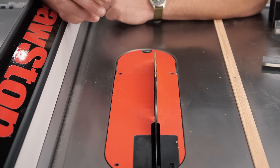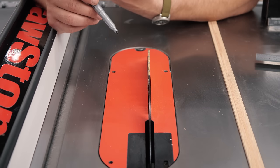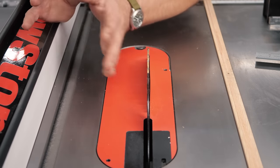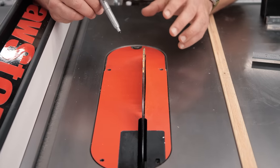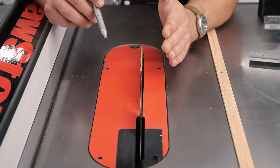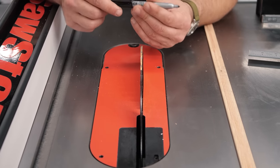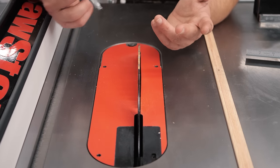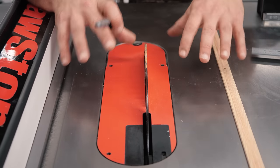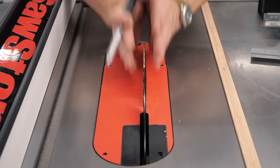The two most critical things are mostly for safety but also for high quality of cut. Sometimes you'll see burning and there's no reason you should be — that can be because your blade is turned inward, causing a pinching motion as you do rip cuts. So what's really important first is that we make sure the blade is aligned to our miter slot. Every saw is going to be different in how this is done — cabinet saws versus contractor saws are different — but all of them can be adjusted. On cabinet saws, the cast iron top can be turned side to side while the blade, motor, and everything else remains stationary.